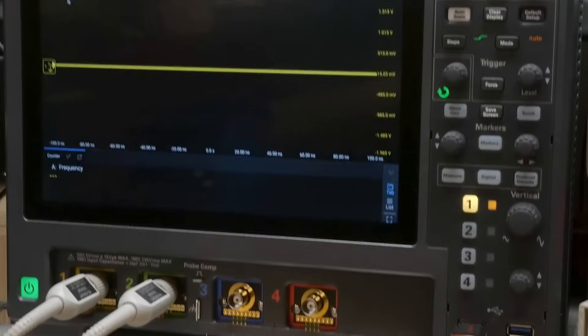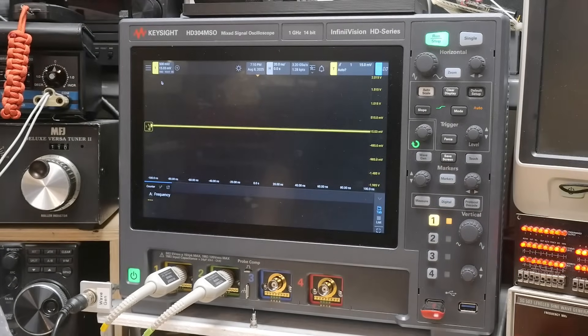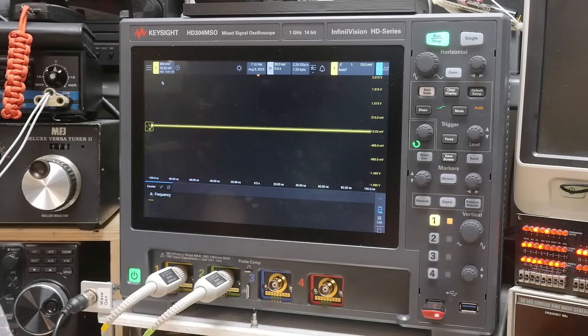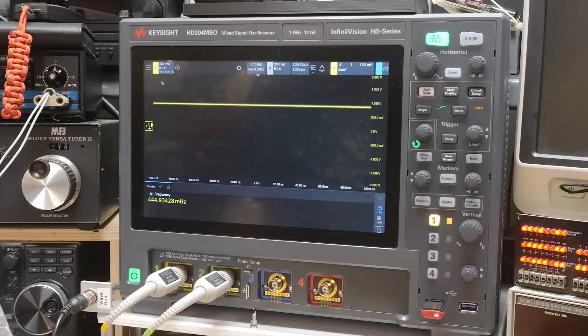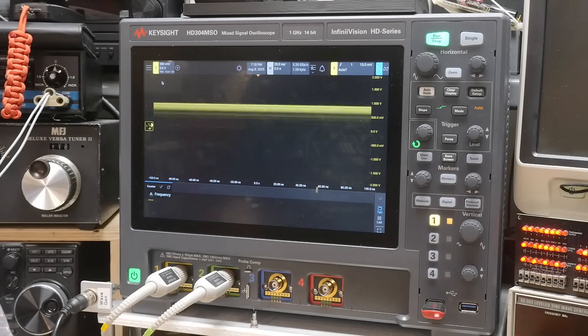Let's go over here and take a look at it. I'm going to be monitoring the voltage across the resistor here. This is one volt, so it's half a volt per division. So if I come in here and close it — boom — it goes up to 0.8 volts because it's got losses. And I let go of it — look at those rings! Boing, boing, boing.